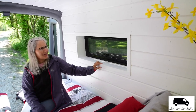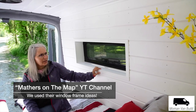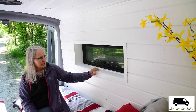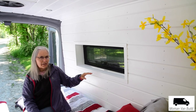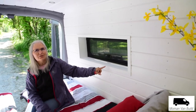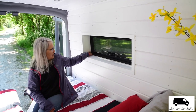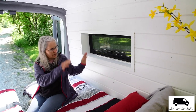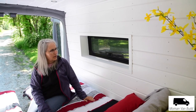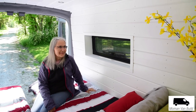And talk about the windows. I also had to get some divine advice. YouTube helps but it doesn't tell every detail for your own situation. First I made these frames that didn't come out far enough — they had to come out far enough to be flush with the shiplap. Angrily, I had to make new ones. This is actually my third set. Finally got them to fit — just measure around the window, make the box. The box had to sit on the frame that was screwed into the shiplap. I made these wooden pieces underneath to fit under the window so it looks nice, then put a frame around it with my brad nailer and fixed all the little gaps. But it turned out great.